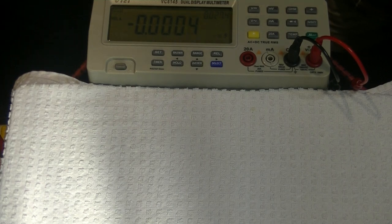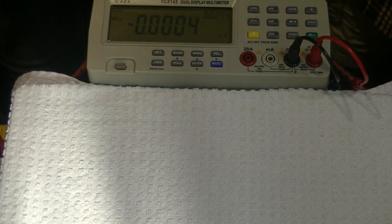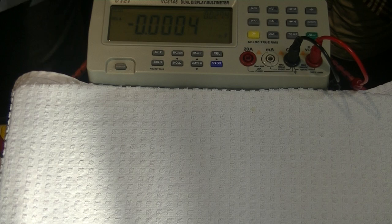Yeah, so if you've got a phono preamp, for example, and you're patching from that over to your preamp, that might be a cable you want to keep really short. Even if its circuit is designed to handle cable length, a high capacitance cable probably would affect the EQ. Yep, and in some schematics, you'll even see capacitors that are put in there specifically to trim those values and make up for the capacitance of longer cable runs.